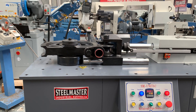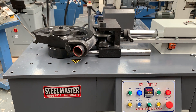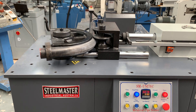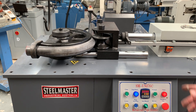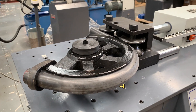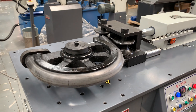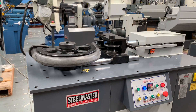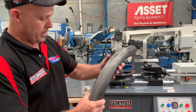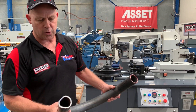That'll self-position, which is good. Hit that and hit that again. Let's watch this thing bend. So this is heavy-duty 50NB pipe, and this is bending it so easily. You could also put some lubrication on that as well, to bend that round so it actually runs a bit smoother — just spray on. But we're just showing you how it actually bends so smoothly and so easily. Goes back out again. And there we are — we'll knock that out. So there's a nice bend. Look at that — that's 50NB. We probably should have put a slightly bigger correction in, but all we're doing today is showing you how good this Uni 76 tube and pipe bender is.